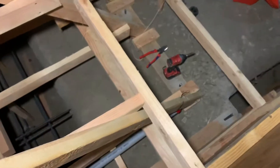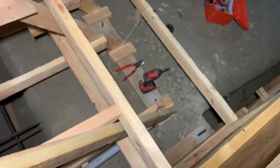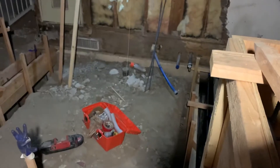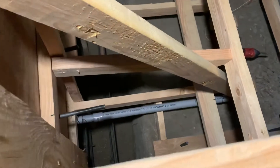That's going to continue on — I'm gonna transition to EMT and tag on to my existing pipe right there on that wall. It should be a pretty smooth transition depending on how the framing goes, but it should be pretty solid. I've got one 90 and two 90s there as I come this way.